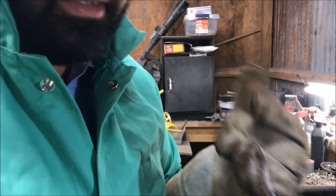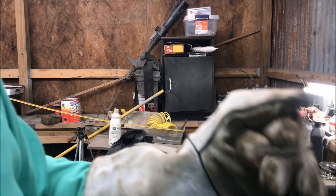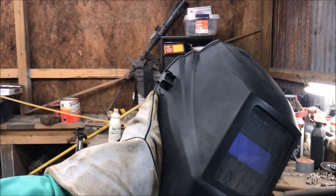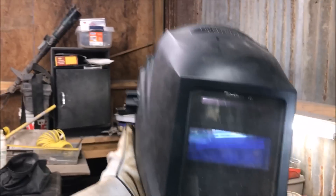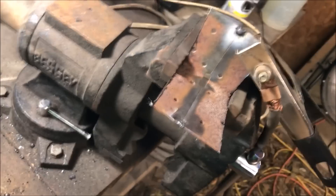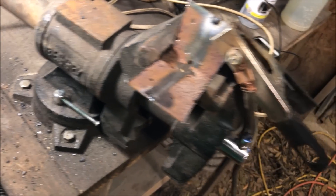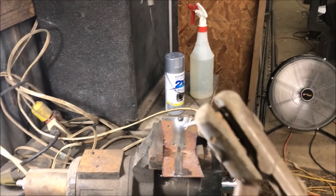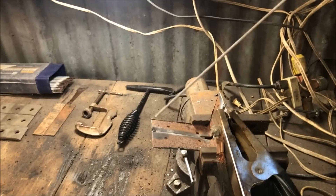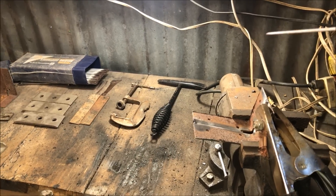You have to wear gloves. If you've never worn gloves like this before they might seem bulky, but you have to wear them — if you touch a place you just welded, it'll burn the skin right off your hands. Don't even waste your time trying to start welding without an auto darkening hood. That whole kit was like 50 or 60 dollars and it came with this. So the first test: we're just welding some 1/16 inch thin stuff with a 1/16 inch rod — this is a 6013. When you first start welding, don't try to weld from an angle where you can't see — weld from the side. We've got our drag angle at 15 degrees to start, and we're going to see how this welds: 1/16 inch with a 6013 on 40 amps.